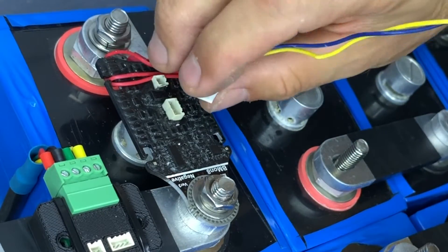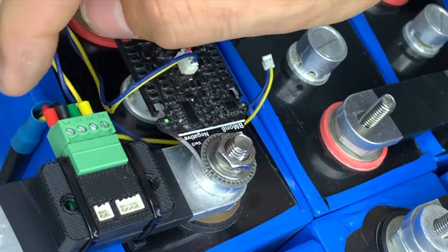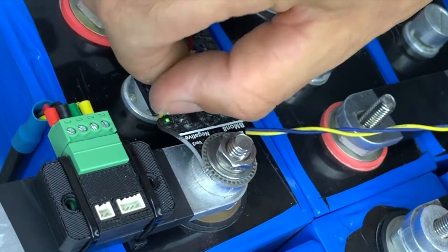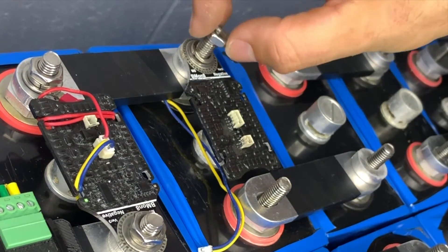These systems are put together not to last for a couple of days but for very long periods of time, so we need to have it wired up very tightly and neatly for when we need to support it later. We take the communication cable from the four-pin and pull it underneath through the slot and across to the next cell, pulling it against the system.